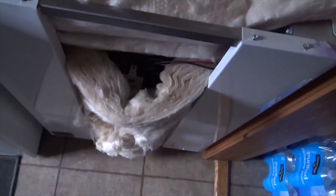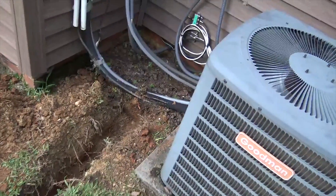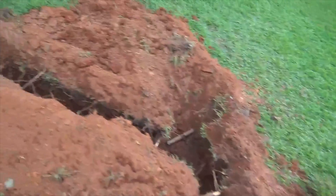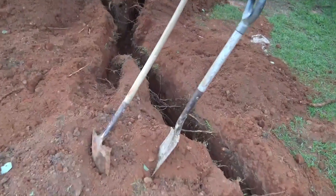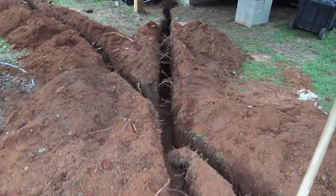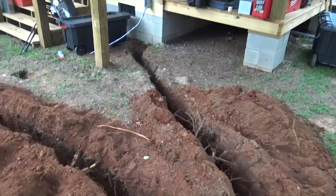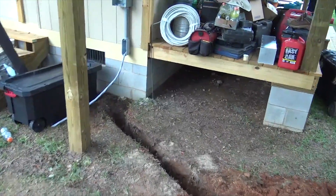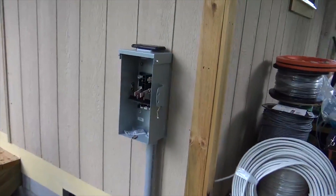We've got a little more digging to do in the shade to get our conduits in. We ended up finding all sorts of treats — water lines, old power lines, the usual; nothing like a trencher to find everything. We are going to set up a transfer switch on this building and feed the output of the Solark to that building.